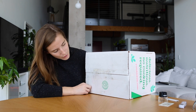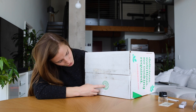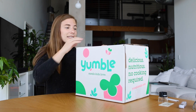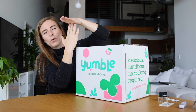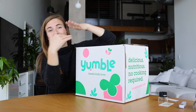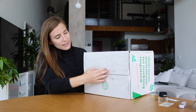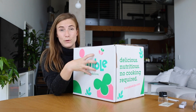The BMC is the Box Maker Certificate. On here, you can actually tell a little bit more about how this box is constructed. This box has an edge crush test of 44 pounds — meaning if you were to take the edge of this corrugated standing up and pile more and more weight on it, when it hits 44 pounds, it'd crush. All of these metrics tell you about the strength of the box, and this is a pretty strong box because it has a bit of heavy food in it.